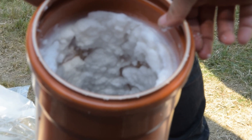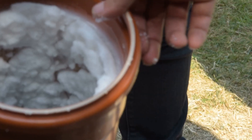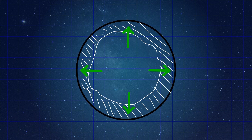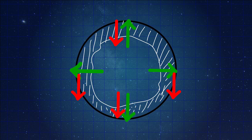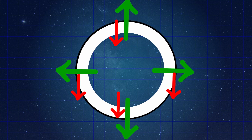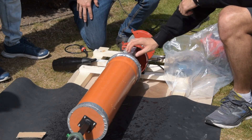One problem at a time. The first problem had to do with the rotation. We didn't have an even surface along the paraffin wax grain in our first trial, because we weren't generating enough centrifugal force to push the paraffin wax to the edges of the tube. If the centrifugal force exceeds gravitational acceleration, it creates a new level — a perfect circle along the inside of the tube diameter. In the summer, we had a huge problem with motor overheating, and essentially lost the ability to use the motor, so we were basically just hand spinning it.